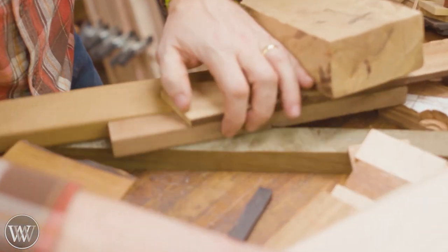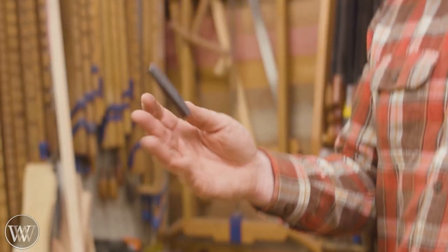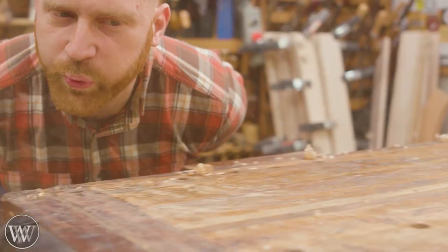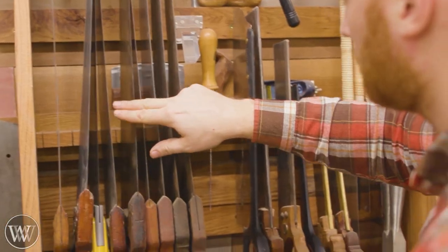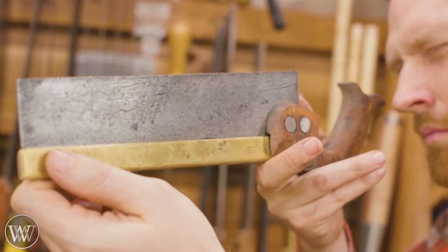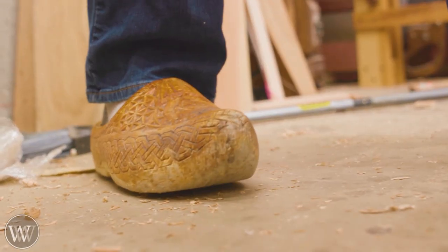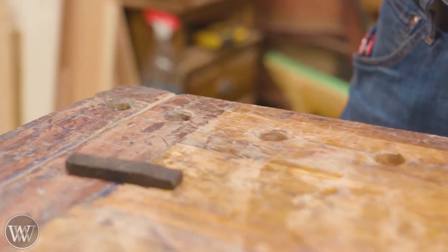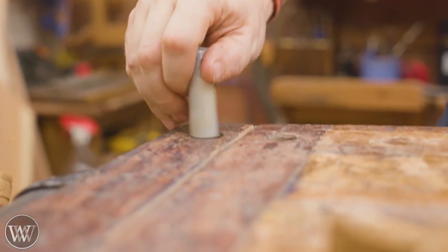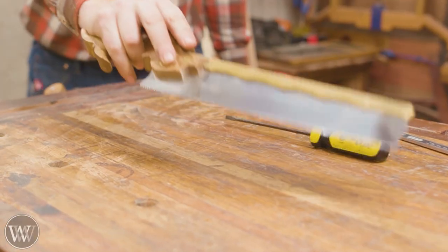I was looking through what I actually wanted to make it out of. I was originally thinking about making a zebrawood toothpick, but then I found this tiny little scrap of old growth ebony and I thought, ooh, this would be fun. We're playing with a bunch of different ways of testing which wood to use — of course the head bonk, that's one of the best ways to figure out what wood. This ebony was sent to me by a friend several years ago and I've used it in a bunch of different projects, getting smaller and smaller. Every time I need a little bit of black inlay for a hand tool or something, this comes out really well. For the cutting, I want to cut it down into a strip that's about eighth inch by eighth inch, so I'm going to grab a dovetail saw which has a rip cut — mine I keep with a rip cut — as I want to basically rip this board down.